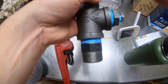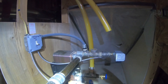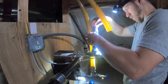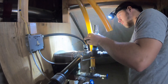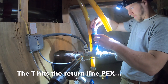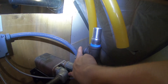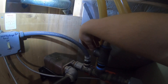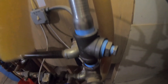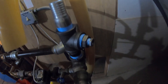So this is the final unit — this is your intake, it threads onto the existing inch-and-a-quarter T, and the sensor is in here. Let's go ahead and thread this on and pray to God it doesn't leak. We got the T plumbed in, going to reconnect the PEX. I put the sensor over here on the side so it'd be protected — didn't want to break anything off walking in and out. We're going to push the PEX back up, heat it up, slide it over, put the clamps on, put the sensor in, run that upstairs, and we'll be good.